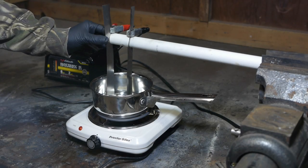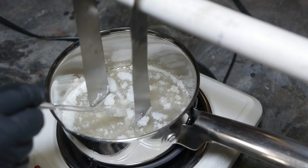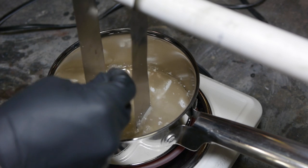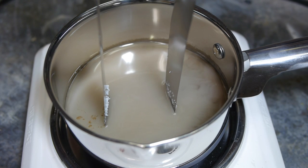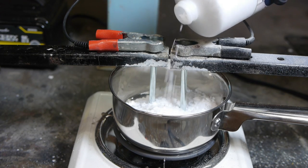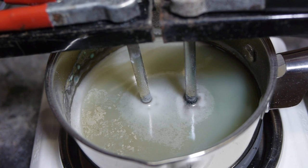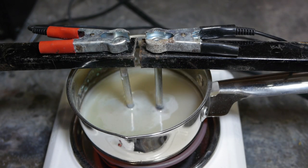This time I'm back to using both a titanium anode and cathode, but using a steel pot as my reaction vessel. Rather than using the flow of electricity alone to melt the hydroxide, I'm using my hot plate so I can maintain a more consistent temperature. Not very much is happening — I'm barely even getting bubbling like I was before. After doing some further research, I realized I might be going down the wrong path with titanium electrodes. The few others I've found who tried this experiment seem to be getting positive results using steel electrodes, which doesn't make much sense to me, but I may as well try it. I'm back to using sodium hydroxide, still in my stainless steel pot, and this time for my electrodes I'm using two steel bolts, which I believe are nickel-clad. I'll let this sit for a minute or two and we'll see what happens.